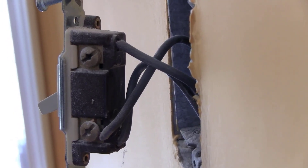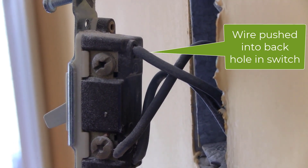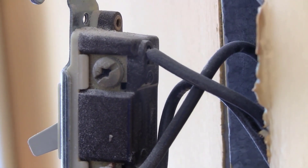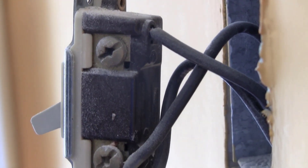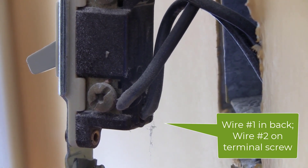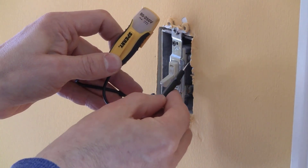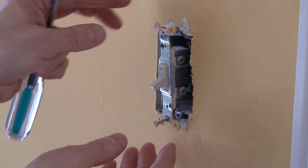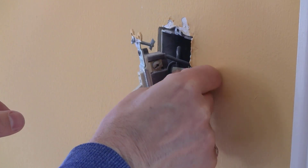You may not see a wire under one of the terminal screws. That's because they used backstabbing or speed wiring, where the wire gets inserted in a hole in the back of the switch. The terminal screw will still be connected to the wire, so it still works for testing. On this switch, they used speed wiring and have another wire connected to the terminal screw for the live wire at the bottom. Turn off the breaker, test that both screws no longer light up, then unscrew the light switch, remove it from the box, and mark the live wire so you can work on the switch.